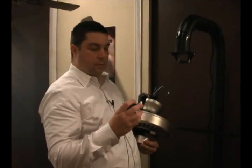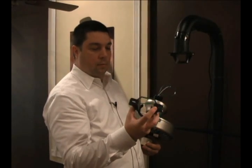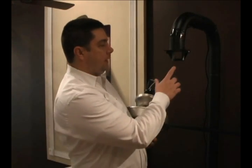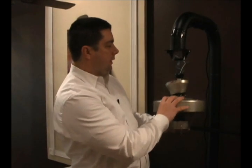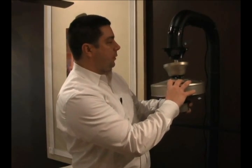The next step is finally mounting your fan to the ceiling. Using your ceiling bracket, make sure that the rubber pads are in place — they need to go between the bracket and the mounting surface. This will cut down on humming, wobble, or any other kinds of noises. Once you have the bracket in place, take your assembled down rod, fan, and motor and set it into place. Each one of these fans has a notch in the ball so it will lock itself into place. Once you get it set, turn it and it will fall into place — this keeps the fan from torquing.